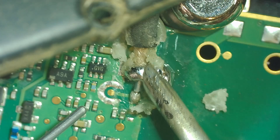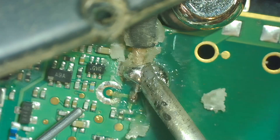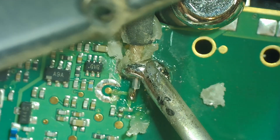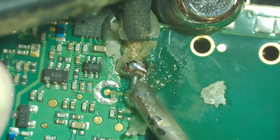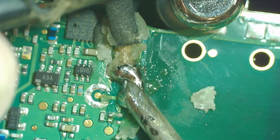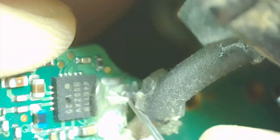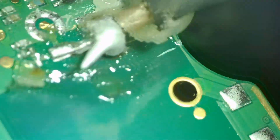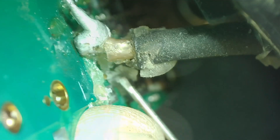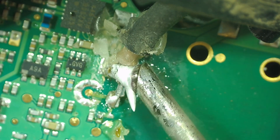I'm showing here on purpose that I left the silicone on top — you can see the solder is completely loose, but look what's holding it: more silicone that's hard to see. We're going to try to get all this loose because we don't want to pull on the pad and ruin this board. That pad is needed to secure the antenna. The tip signal pad is so small it would not secure well if we tried to repair it, and it just might not hold up in a rough environment. We want to protect these pads at all costs.